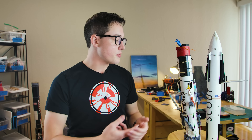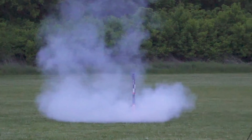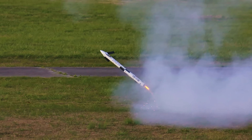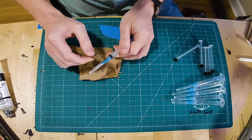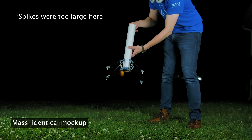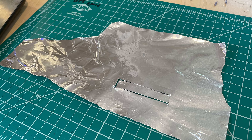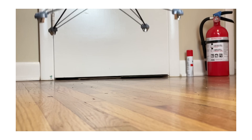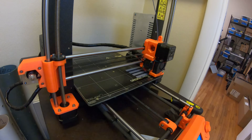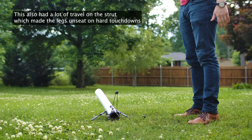The biggest visual change from Flight 1 to Flight 2 is the landing legs, which have these syringes attached to them now. The landing legs have been a problem since day one of trying to land one of these things propulsively. There's always bounce or hop or slide or all sorts of problems that make it so that we tip over on landing on what would otherwise be a good upright success. I used syringes on Flight 2 as a sort of gas damper slash shock absorber, but I went through a painstaking process of trial and error to arrive here. I tried spikes into the dirt, but that was difficult because dirt isn't consistent across different moistures and different locations. I tried crush cores with aluminum foil that was rolled up to dissipate the energy on impact, but that only works if you're landing on a hard, flat, easy-to-slide-on surface. I even tried dampers made of 3D-printed segments where the carbon fiber rod could slide in and out of the segment, but the static friction was very high while the dynamic friction was very low. The syringes were a nice even ground between all of these things that I tested.